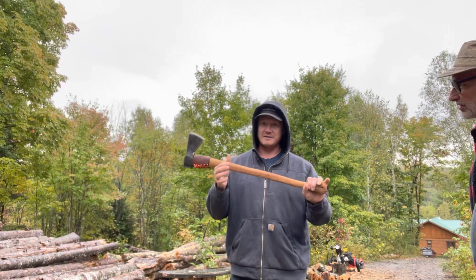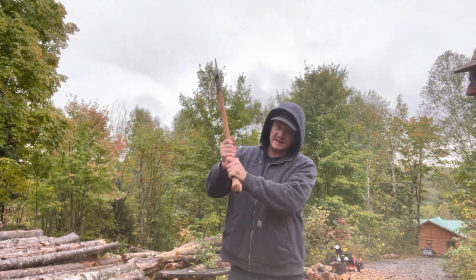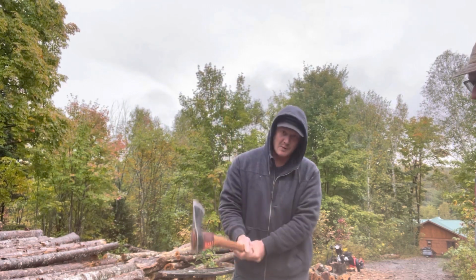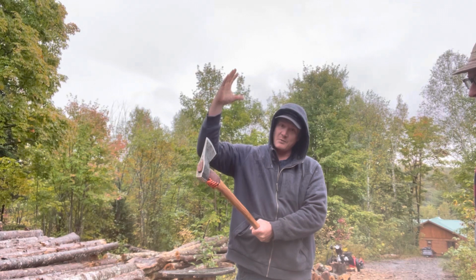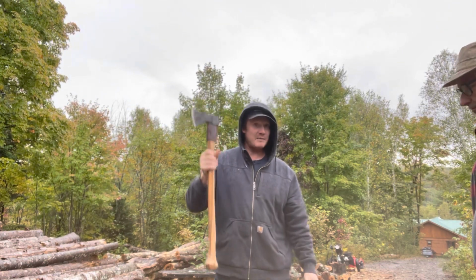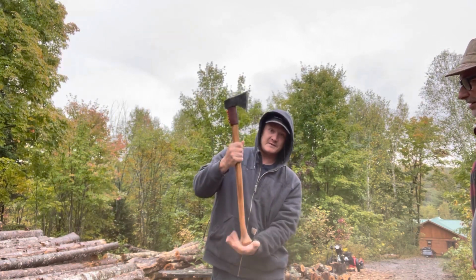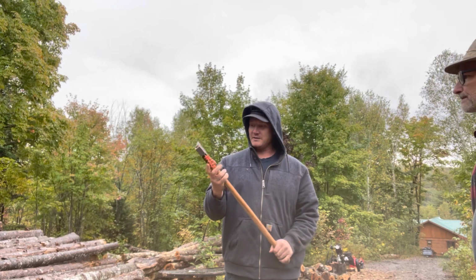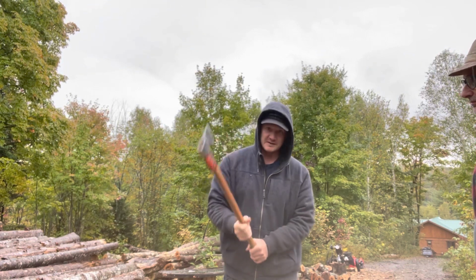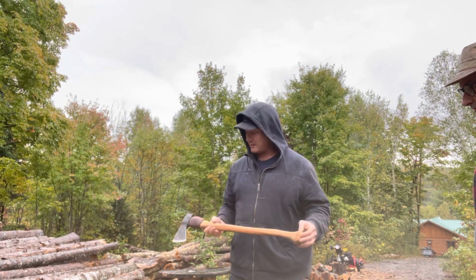One of the things that you like to do with an axe is, when you hit it and the axe doesn't go all the way through, instead of pulling the axe out or keeping on chopping it with the round connected to the axe, the best thing to do is flip it over like this, boom. Hit it on the butt of the axe, and that way the weight of the round will just fall on top of the bit and split. It's the same thing when you're putting a hammer handle back on or an axe head back on. If your axe head falls off, you don't go like this, you go like this and bump it, right? So it's the same kind of principle. But to do that, it's good to have some protection on the top of your axe. Over time, you can damage the axe handle if you're constantly flipping it upside down and beating it like that. But as you can see, this axe just made real quick work of that wood.